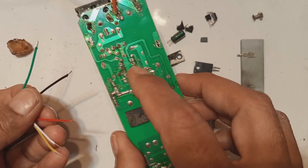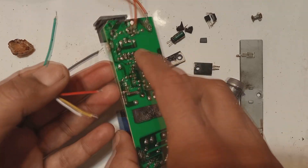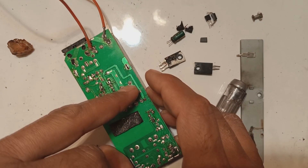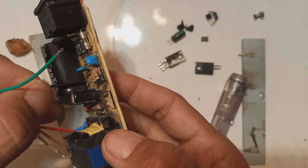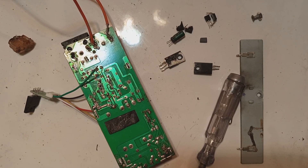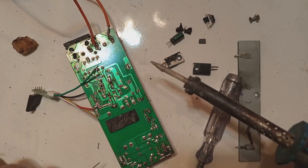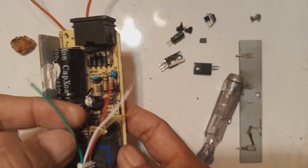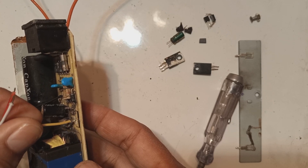We are going to put the black wire to the negative side of the capacitor — the primary side hot-side negative. We will introduce this black wire there and solder it. You can confirm the negative from the capacitor markings as well. This is not very difficult for anyone dealing with electronics. Using a soldering iron and soldering wire, we are soldering this black wire to the negative trace. Now is the time for the yellow wire — we are soldering it to the drain of the MOSFET.